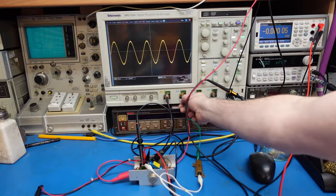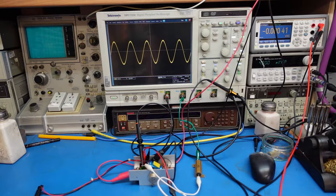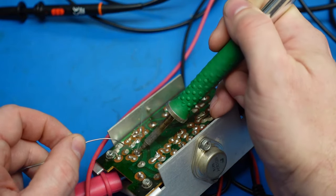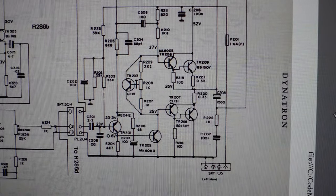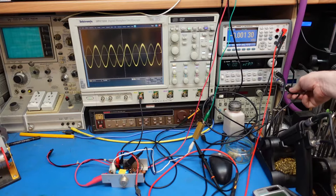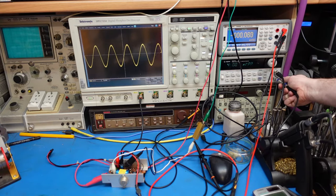That's much better. Connect the load to earth. I think it's good. I'm not sure what went on before but it's not doing it now. We'll resolder that cap back in and see what difference that makes. Turn that back on - oh my god, it doesn't like that. So I'm thinking there's something odd going on from this snubber network here, because that's all we're disconnecting when we lifted the capacitor out. Hang on - is this just a bad lead? Dodgy test leads. Yeah, this is working fine - messed me around a bit, bloomin' dodgy cable.